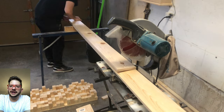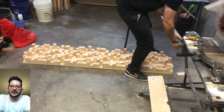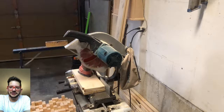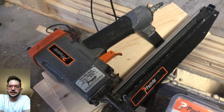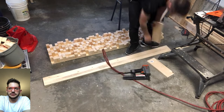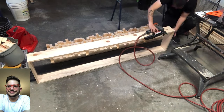Once I got that first piece cut to the right length I use it to match the other side — and those are our two long pieces. Now I can cut the interior pieces and go back and forth until everything is confirmed to line up. I want the side pieces to be ever so slightly longer than the short side of the diffuser to ensure that sixteenth-to-eighth-inch wiggle room so we can actually get the frame onto the diffuser. Here is what I use to nail the frame together: a 16 gauge finish nailer with two or three inch straight finish nails. For the test fit I'm just putting two nails on each side so that if we need to take it apart and trim anything, it's not completely secured — saves some pain.